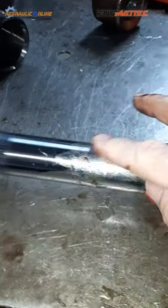This is on there. That goes in there. So what stops oil going under here and leaking to the other side of this chamber? Oh, what's in there? There's a little O-ring in there that I haven't taken out yet. So this basically does the job of keeping oil out. It prevents high pressure oil, because we're talking thousands of PSI, from leaking past there, through there, and then losing power, or actually allowing this to creep and move in.